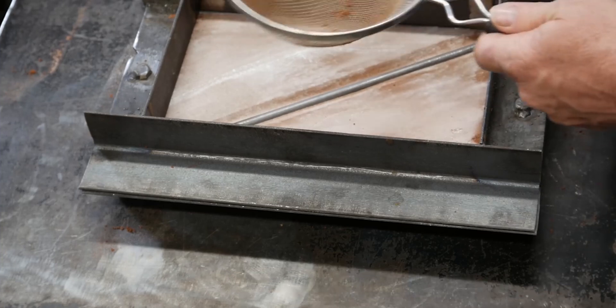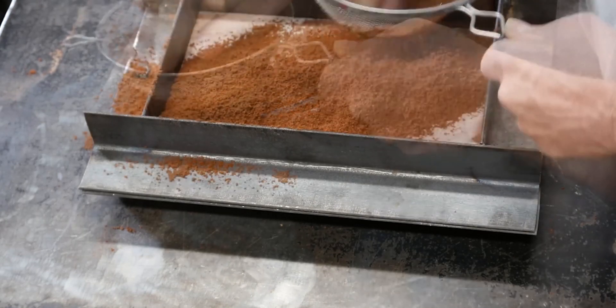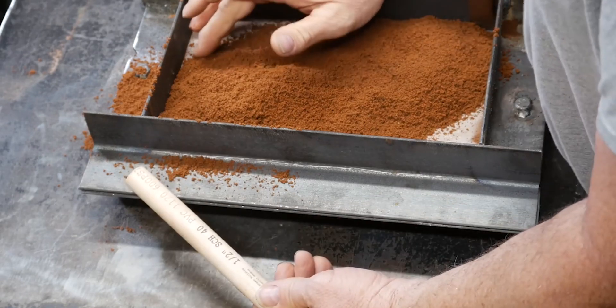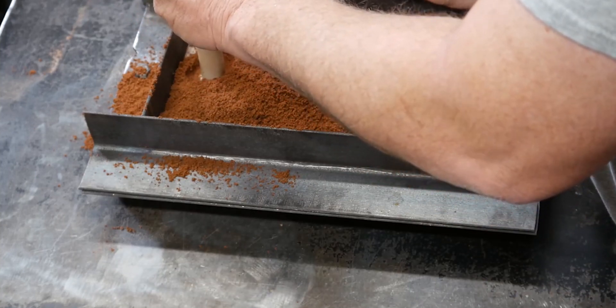I'm going to show you a couple of clips of previous castings and venting that wasn't great. It works, but we're going to show you a better way. This is an early video of mine where I cast a 3⅛-inch aluminum rod. I really should pull it down because I cringe every time I watch it. You can see what I'm about to use for a sprue and for a vent — a piece of ½-inch PVC over on one side. It's a huge thing.